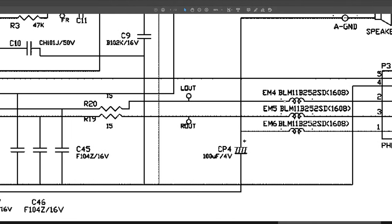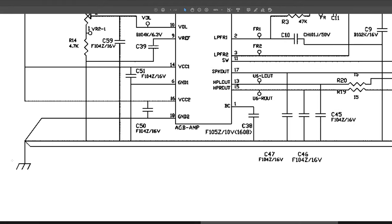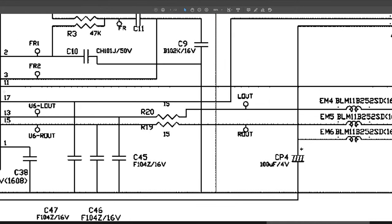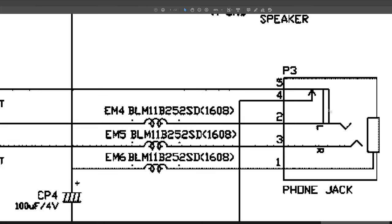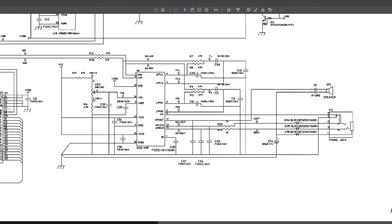So to test that and to know that, you take a working board. And then if you look at what happens, pin 4, if you follow the line, goes all the way across, and this is the ground symbol. Again, it's an old symbol for ground, but that's a ground symbol. So we know pin 4 is grounded, and pin 5 goes back to the amp to a pin called SW, which will probably stand for switch, as in switching between speaker and headphones. So again, I know this because I've done enough of them, but pin 4 and 5 will go between simply not being connected, so pin 5 won't be connected to anything, to being connected to ground when the headphones is in. I know this is going to be an issue and prevent the speaker from working, so I'm going to swap that first, and instead of just putting a headphone jack on, I'm just going to short out pin 5 to 4, or effectively just pin 5 to any ground point.